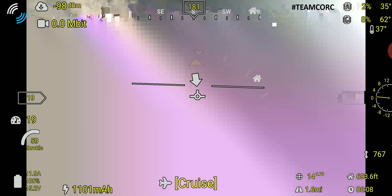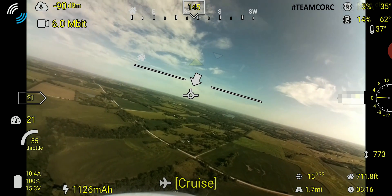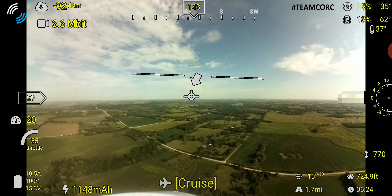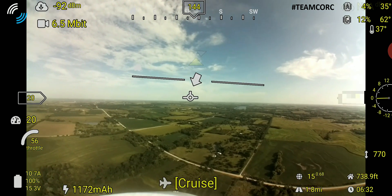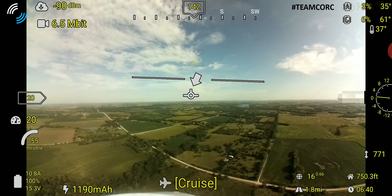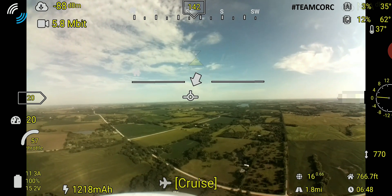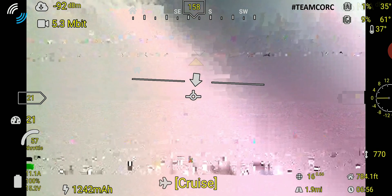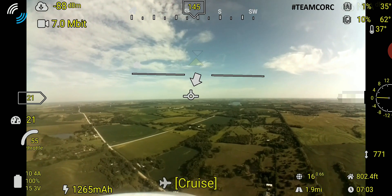At this point the video's breaking up and staying broken up for a little bit, so I changed my heading a bit — decided to head a little more southeast versus south — and the moment I did that, you can tell the video reception has gotten better. On the ground I've got a couple of patch antennas and an omnidirectional right-hand circular polarized antenna. With no tracking, I've just got the patch antennas pointed in a general direction so they're not perfectly aligned, but they are giving me pretty good distance. I also started testing what would happen if I put my hand in front of the patch antennas, and you can see the video freeze for a moment — it definitely has an impact if something's blocking line of sight. But overall, 1.9 miles out, I'm very impressed with the distance and coverage with these cheap antennas and this OpenHD system.